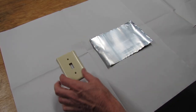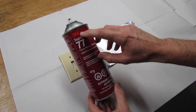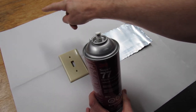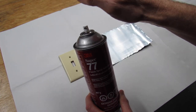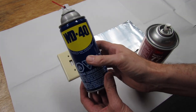Take your two pieces and lay them down on a scrap piece of paper. The best adhesive for this is Super 77 made by 3M — check the description below for a link. Make sure you're not using it over a good surface since it has overspray and is very sticky. If you do get overspray somewhere, just use a little bit of WD-40 to get it off.